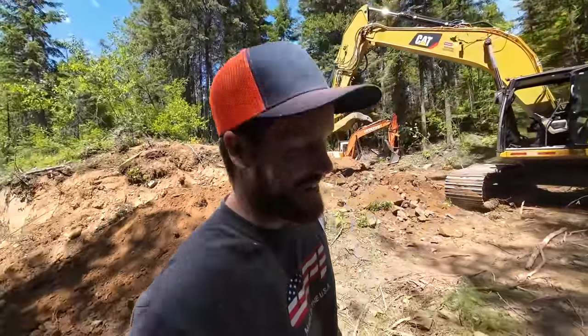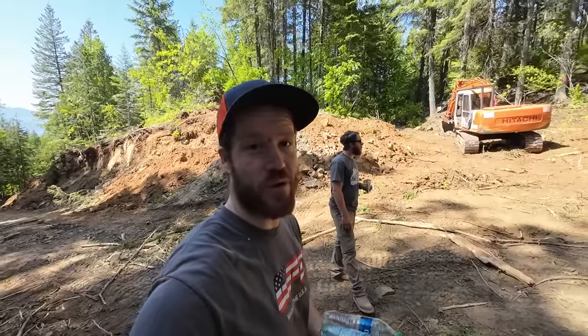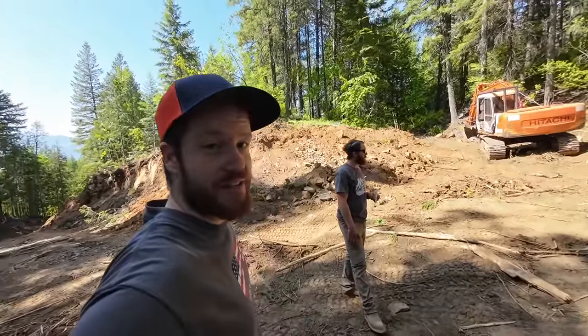No, that is solid — we're going to need the rock hammer for that. Demo phase is finally over and it's time to enter the construction phase. We're actually going to start by pulling this top layer of topsoil off and throwing it down into the road so it ends up as the bottom layer of fill, where all the little roots won't matter. Then we're going to get as much of the rocky material out and put that on top. I'll start at the bottom in the Cat, Tyler's going to be here at the top in the Hitachi, and we'll meet somewhere in the middle.